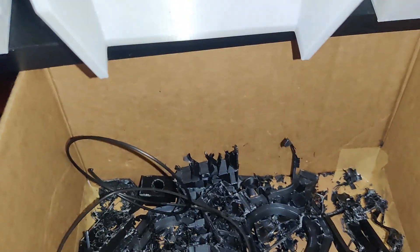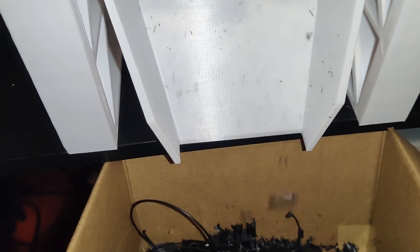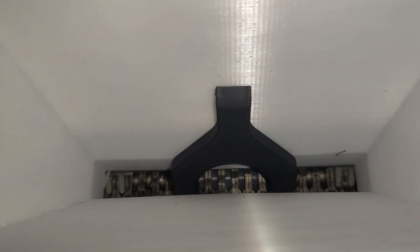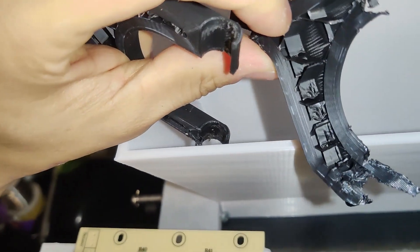There's already material coming out of it. The issue I suspected would happen is that the shredder gets jammed — too many things or too strong of 3D prints can cause it to get stuck, and I'll have to press reverse to pull the print out and redo it. I've also noticed that 10-wall infills or around that thickness just won't go through the shredder, so I'll have to cut them up manually into small bits until I upgrade with a better gearbox or a better motor.